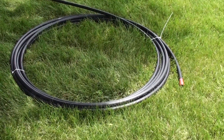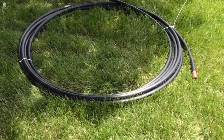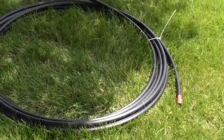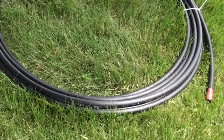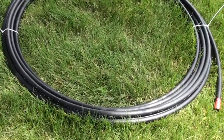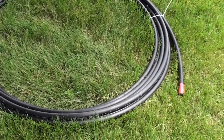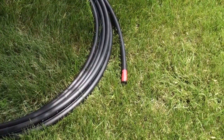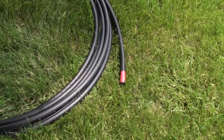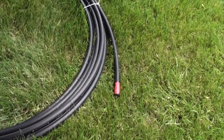My name is Jerome Kunze. I'm documenting my assembling of the slinky for my geothermal that I bought from Ingrams Water and Air. I have 75 feet rolled up here that's going to go from the start of the slinky into my utility room to the manifold. I've marked one end with red tape here so I don't get mixed up once this is buried — which is supply and which is return.